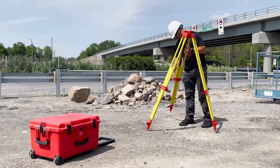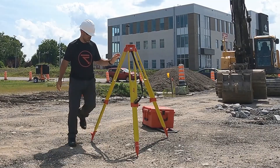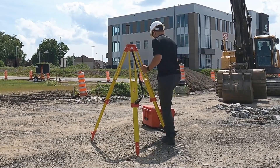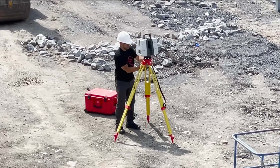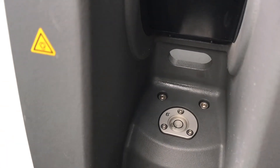To get started, you'll need to set up a sturdy, survey-grade tripod. You'll want to press down on the tripod legs so they won't settle while the scanner is in operation. Securely fasten your P-Series scanner to the tripod, then level the scanner using the dials on the Tribrach while watching the bubble on the Tribrach or on the scanner itself.